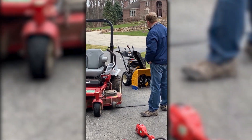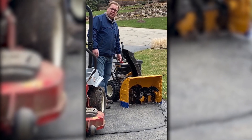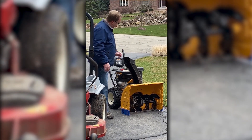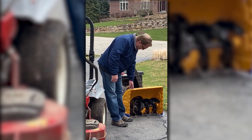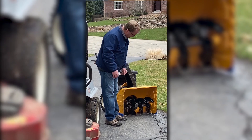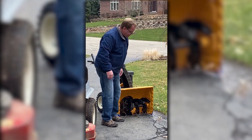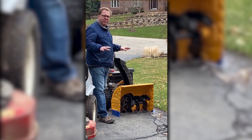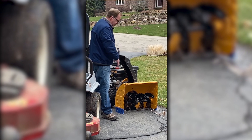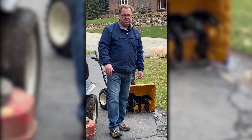We talked briefly on the snow equipment. I mentioned the fuel stabilizer — go ahead and add some fuel stabilizer into the fuel tank, let it run for about 15 minutes to get it through the system. Then take an inventory and make sure your scrapers are good, so you're making an inventory for next fall. And remember: whenever you're doing any maintenance, make sure the switches are all off and spark plugs are disconnected before you reach in and do any inspections on those products.